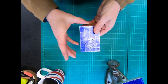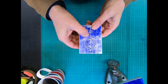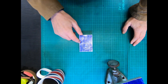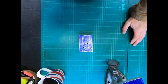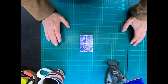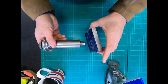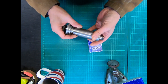Finished on the jig borer. It's not wonderful, to be honest — well, actually I've achieved what I wanted: a load of holes to be able to saw around and file to. There was probably no need to center pop for the drills — I added a couple of holes and it went through without one. But the BCA jig borer worked very well, so I'm very pleased with that. Now it's just a bit of elbow grease to cut around here and file to get the watchmaker's spindle for the Unimat SL to fit through.